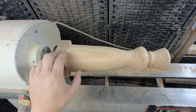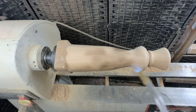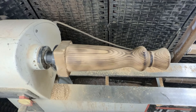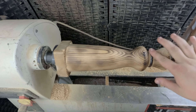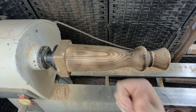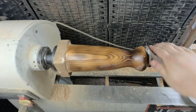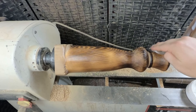I don't want to hold the flame on it too long and have it crack. All right, I think that's good enough. Now I'm gonna get my Yorkshire Grit, put it all over here and buff off all that soot. You want to apply it all over the piece and then buff it off until that sandy texture goes away. I'm also using the black abrasive pad just to get off all those minor bumps.